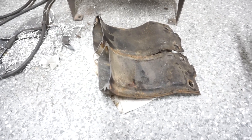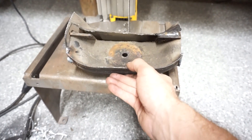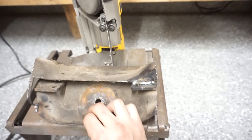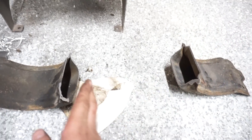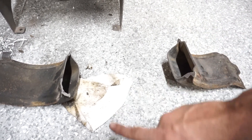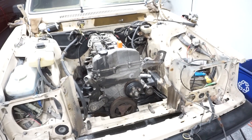I did a little modification — cut the middle section out and modified it, twisting it so I could run a GM mount and bolt through it. I just couldn't bring myself to use it as-is. What I'm going to do now is take these pieces for the mount, block this off, connect them in the middle, and run a bolt through with a GM mount. Real simple — patch that up, run a piece across. What do we do next for this thing? Start building a turbo manifold — that might make sense, that might be fun. Turbo manifold and intake.